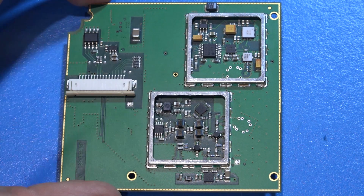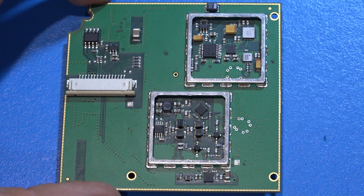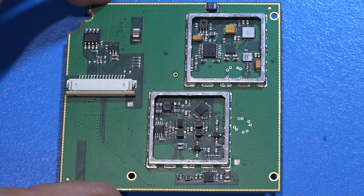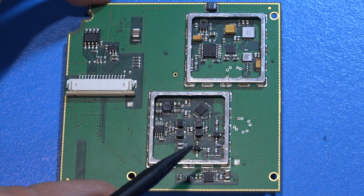And this leads us even more to think that there is a quadrupler on the RFIC I just showed you in the front end of the unit to create the necessary LO frequency to be in line with the frequency that's coming into the unit. So the LO synthesizer portion is really quite straightforward. The IF is a little bit more interesting.